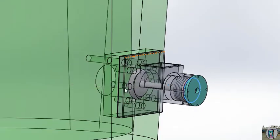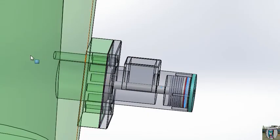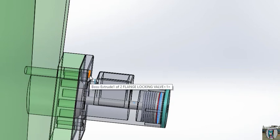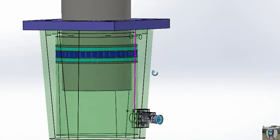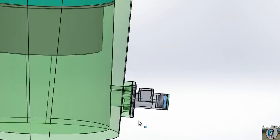We have to give that oil pressure from here — this is the locking pressure. What pressure we need? This is the hole directly inside, you can see. We will put one pipe here to lock the pressure. How much we want — we can give 130 or 120, as per the requirement of our mold. When pressure will come — suppose we have set 140 — as well as pressure will reach around 140.